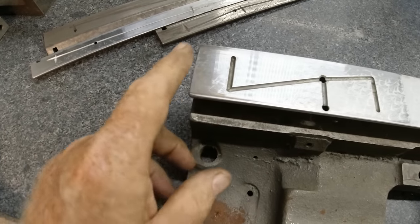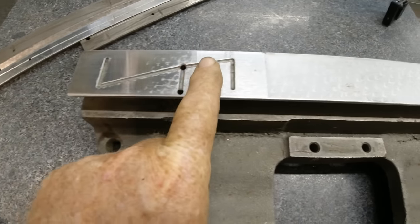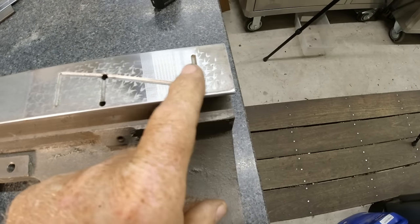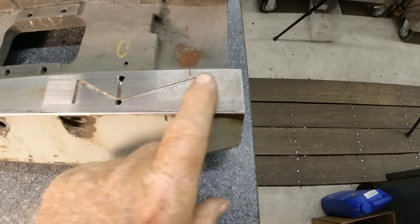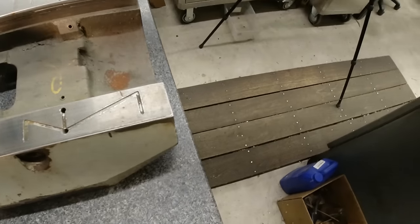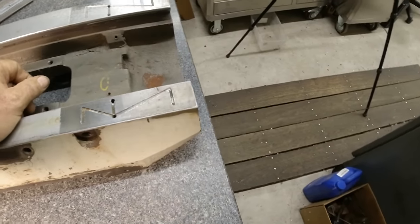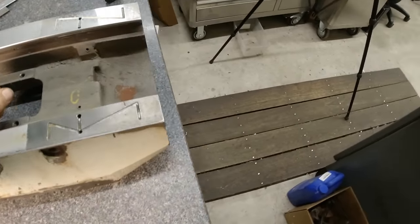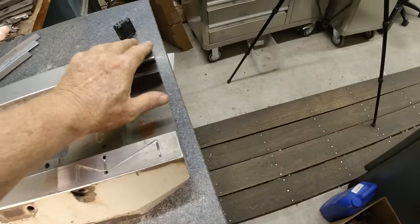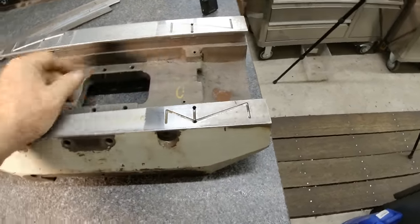Look at this pattern here. Out near the end, it's worn away much more than back here. And it's the same thing over here. This little section here is worn away. Over here, it's even worse. And here, too. Dirt and stuff get embedded in the wipers. So change your wipers regularly. Every couple years, every year, they're cheap. And they'll help keep dirt and junk from getting underneath here and just acting like a big Brillo pad.